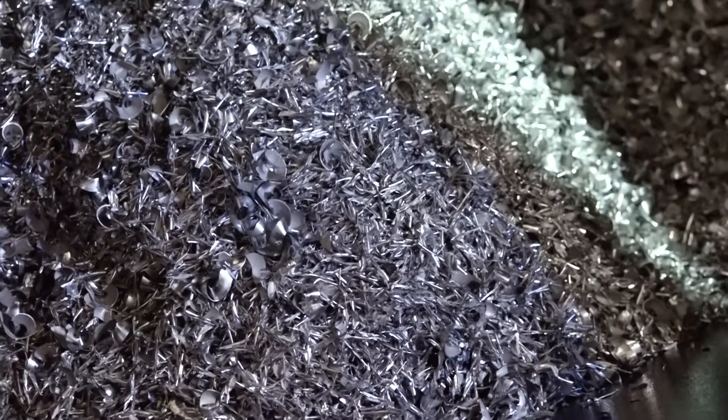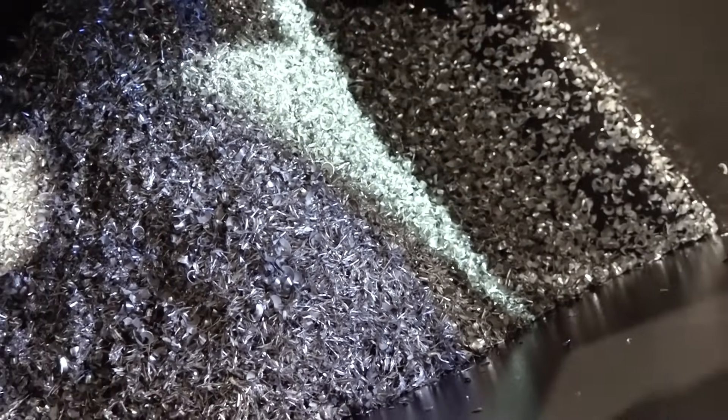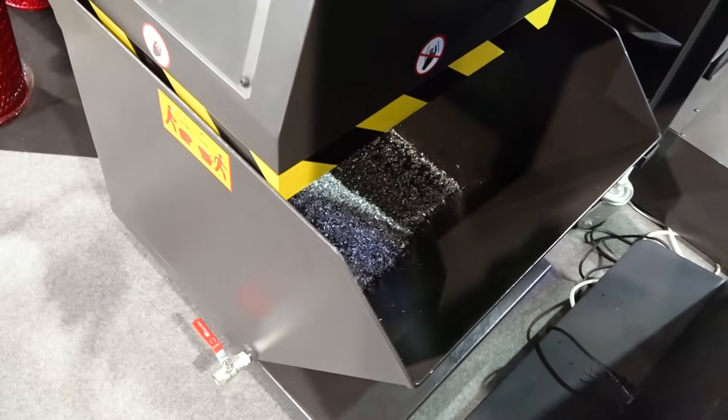Having enough tools is critical, especially when you can have up to 18 pallets. But think about the chip conveyor system too. What a customer doesn't want to do when running automation is clean the coolant tank and chip conveyor all the time. We have a very nice system here — both a scraper type and a hinge type — that gives you the ability to run 24/7 without having to have someone clean it out constantly. We've thought about both the tools needed and the chip conveyor side, because you don't want to waste time on either.